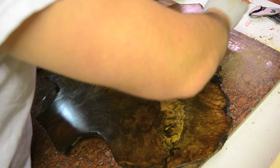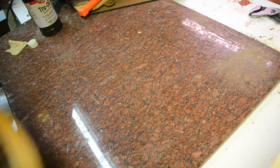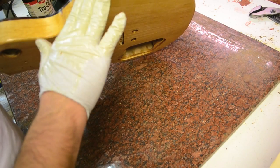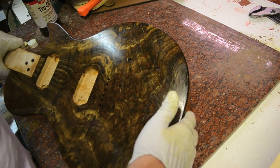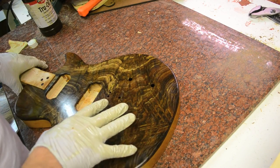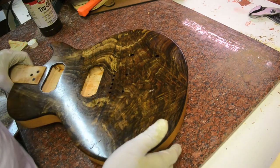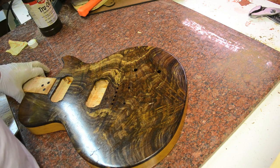Now I'll let this sit for a couple of days, make sure it's really nice and dry, and I'll take it to my buffer. When you're doing a guitar, you're going to run into end grain. End grain always needs more coats on the sides than on the top — so if you do four coats on the top, you'll most likely be doing eight coats on the sides. This one's got two coats already on it and you can see it's not building properly because of the different figure in the wood running all different ways, and on the sides it's not building so well. So on a guitar I'll probably do three or four coats full across the whole body, then do a couple more coats individually on the sides, and then I'll show you a trick where you do some wet sanding on the sides with the end grain to help it really build.